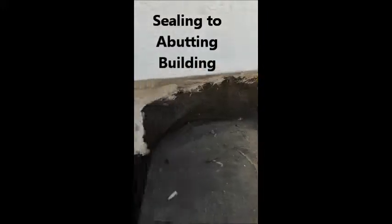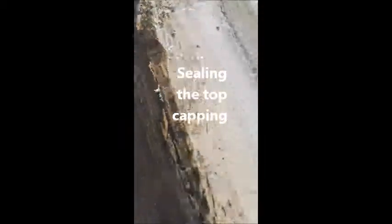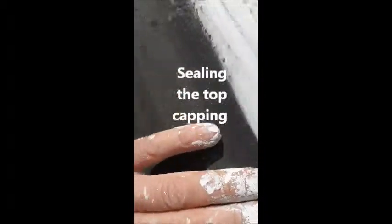Just want to show you this in here. You can see, in there, it's all totally sealed up to the top. And then I have a little track to put down into the filler to come on down to run it off into the valley. Here, I sealed up the top with caulk all the way along. This is the only bit I had to come over a little bit, and I've sealed it up. I've also stabilized this area here. When that dries, I'll put a coat of paint on it. Okay? So we stabilized that area. And then I use a product called EB on top of the stabilizer, which is a gripper. And then I'll put another coat on tomorrow. Okay? Thanks.